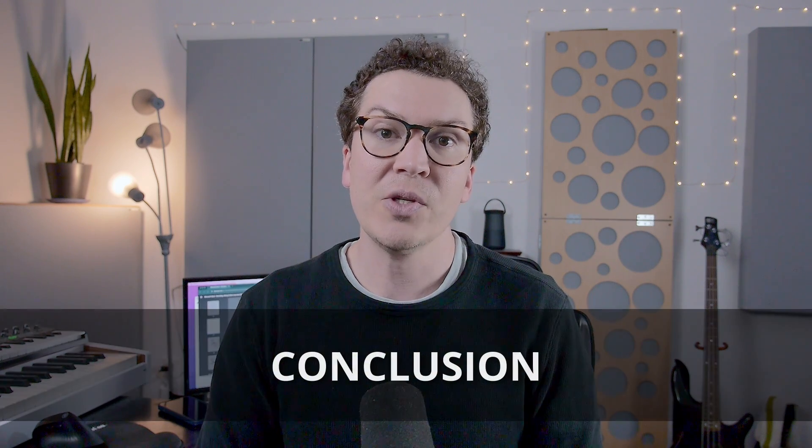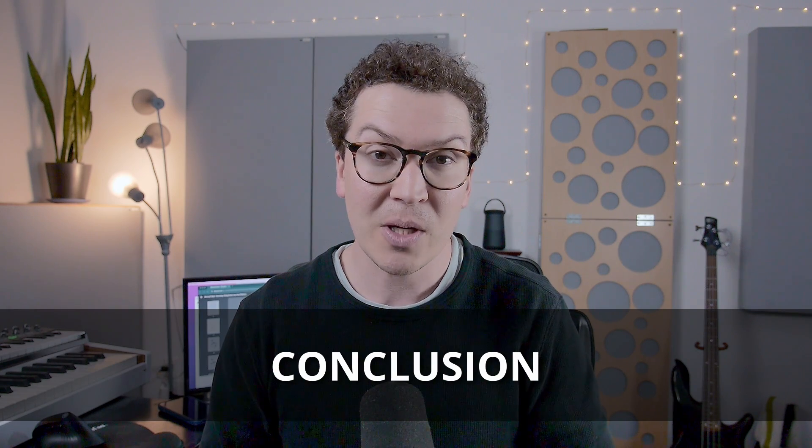In conclusion, we've covered what grounding is, what ground loops are, and some ways to minimize or completely eliminate ground loops in your studio design. The zero loop system is my favorite because it's a simplified way of thinking through how to avoid ground loops. The main takeaway, as Philip Newell says, is that we're trying to create the path of least resistance for the ground — always going directly back to the main supply electrical panel and avoiding all other electrical branches. The more we can have our audio on its own dedicated outlets going to its own dedicated spot on the electrical panel, the better we'll be at having clean electrical in our home recording studio.